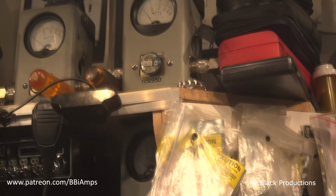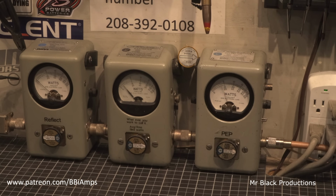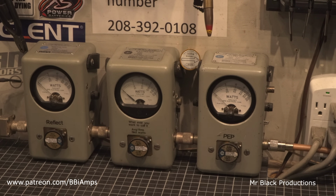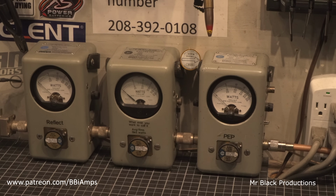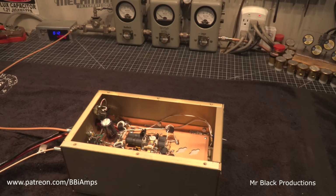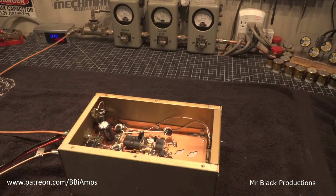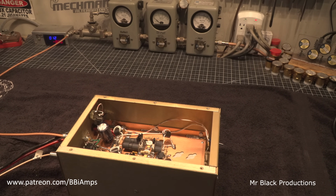Hello. Our output power is, hello, audio, 200 watts. It should be up in the area of 400 to 500. Let's get out the trusty, dusty old FLIR here. Let's take a look and see what's going on. We all know that this isn't right, so we're going to go ahead and we're just going to pray that all the transistors are still good.